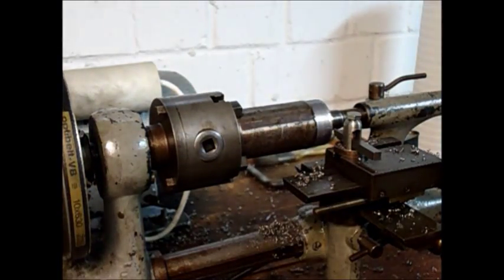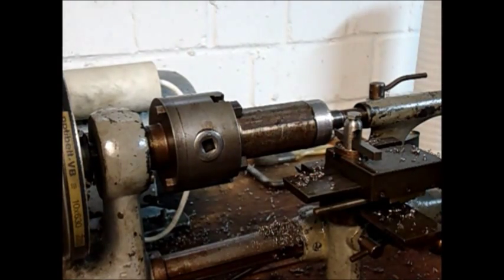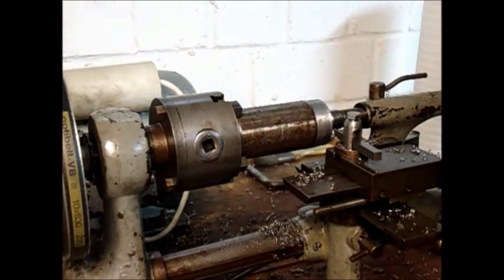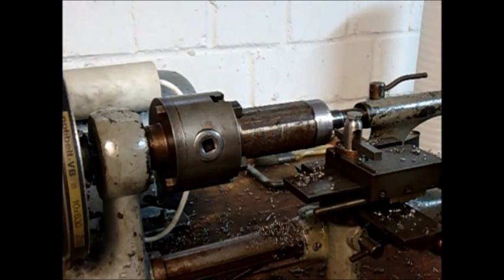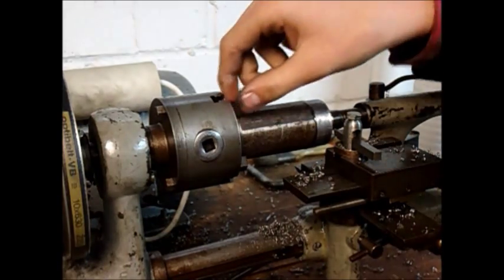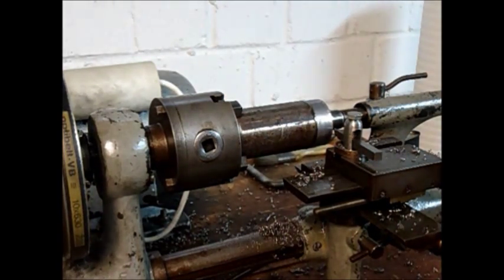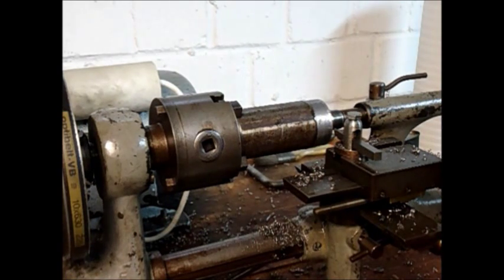Okay, we've got to true it up now. We'll just take a measurement here — that's right at 40mm, and to allow some place for the carrier, I'd say we will rough it down to 35mm. It's not a critical measurement, it's just the outside diameter for the part.